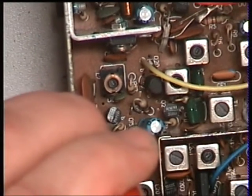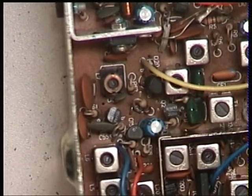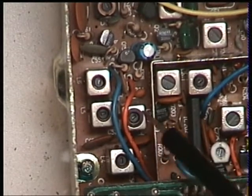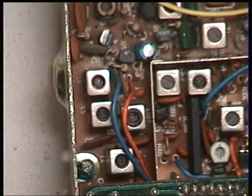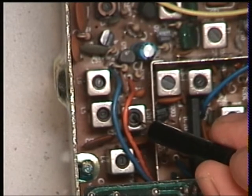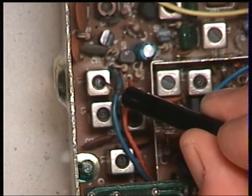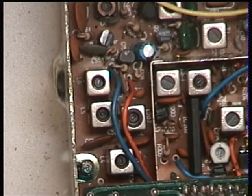You've then got four coils to adjust. The first one is L207, then L4, L5, and then L6. By that time you should be able to set the frequency with CT201.